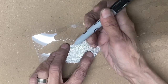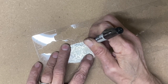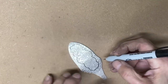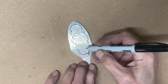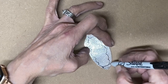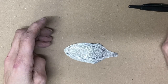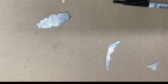I started out by flattening the spoon bowl and then running it through the rolling mill with a beautiful texture plate. I am using one of our new templates and tracing out my desired design onto the flattened spoon bowl. I am adding some shank areas to the design and depending on the size of the ring you are going to make those longer or shorter.